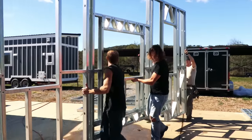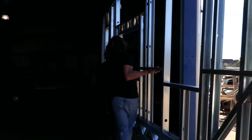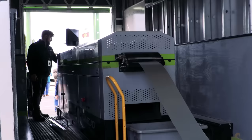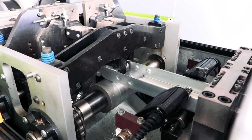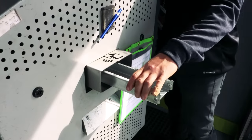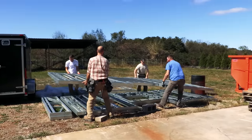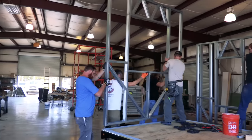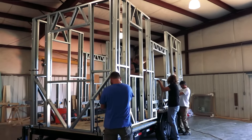Once the floor was laid down it was then time to erect the steel frame. This part of the build is tremendously fun and quickly transforms the trailer into something which resembles a house. With our partners at Volstruct, who provide our framing, their machine literally prints the studs, dimples all the screw holes — everything is flush and perfect within a millimeter of tolerance. Our walls are panelized and put together for us, so all we have to do is put the panels together, straighten everything up, and secure it properly. On a 16-foot house we literally just pick up the walls and set them on the trailer all the way around.